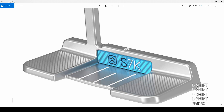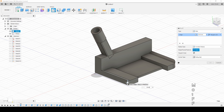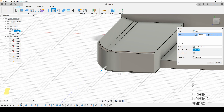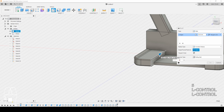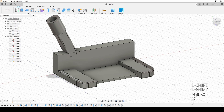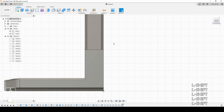We've got the basic form of it. If we look at this, you're going to notice that these are all rounded edges, which we will do — especially on the outsides here, because ours is looking pretty square. I'm going to go down to a 10-millimeter fillet on that side and 10 on this side. Then we want to fillet the edges — let's do a one millimeter. Looking at our reference image again, we have even more fillets right there, so we're going to do those by 0.5.